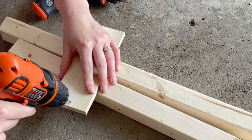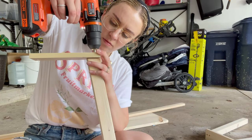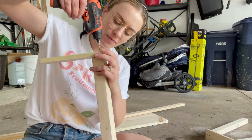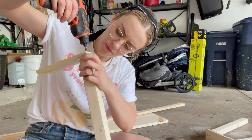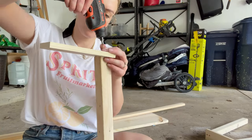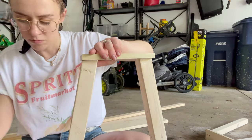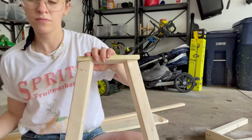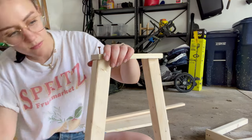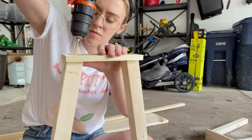Only do one end though. Drill pilot holes at an angle at the end of each 7-inch piece — this will ensure that the wood won't crack. Then assemble by drilling another hole to make sure that you get it through the leg. Add a little bit of wood glue, and then use a screw to put it in. Sometimes I like to do one screw, sometimes two — whatever feels right for you.